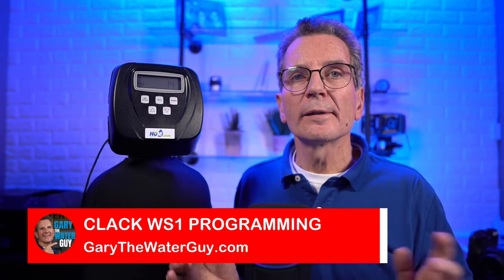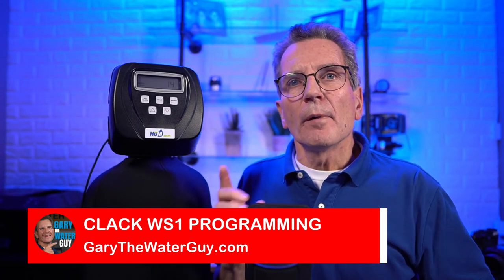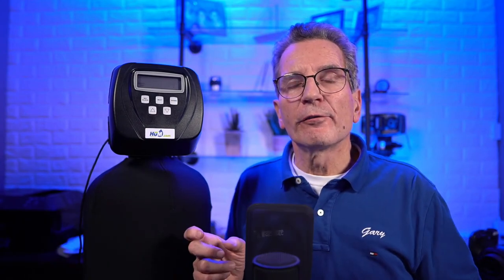Why would you want that? So again, a water softener has to regenerate every 14 days because you have to kind of fluff up that media every 14 days. Otherwise, it can become hard. And that's one of the problems with putting in a water softener that's too big, especially if it's in a cabin or a cottage-type environment where people aren't there full-time, people don't live there. So in scenarios like that, you have to make sure you set that days override.